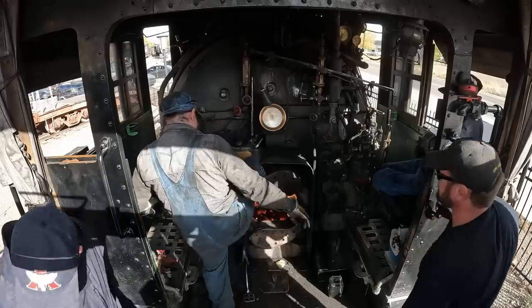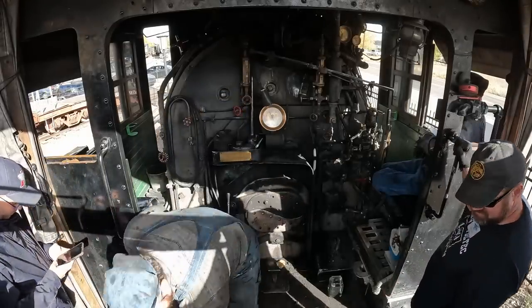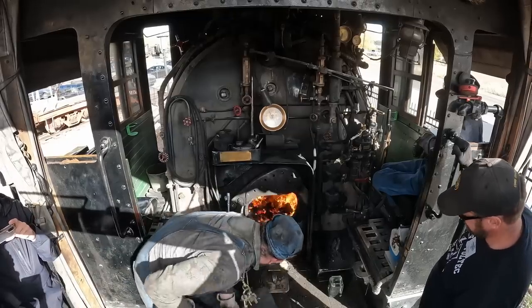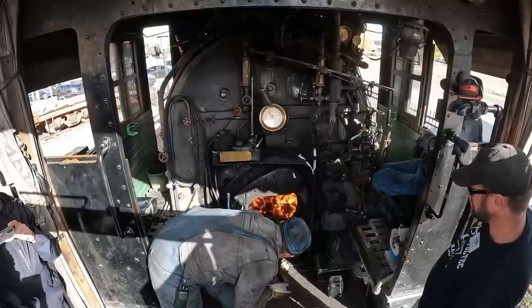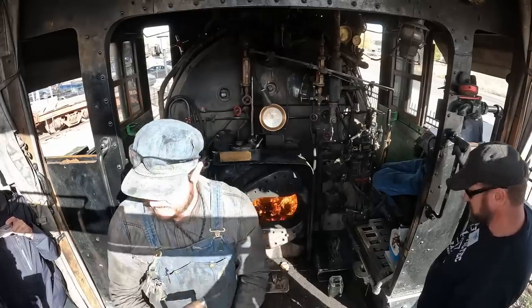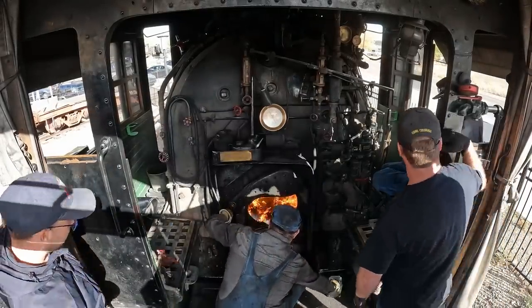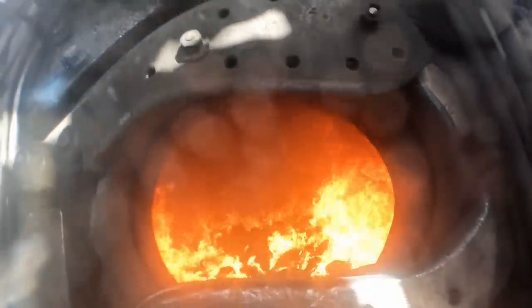It's not the end of the world. So I'm adding more coal, for one thing to help roll existing coal into the dead spot, and as well to help fill out the fire mass in that area, because it was a little uneven. She'll spread that. And we can see with the fire cam one more time that it's already started to light on the left side, and with the blower still rolling, it'll light the rest of the way.